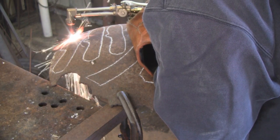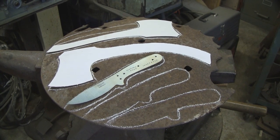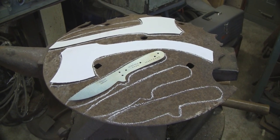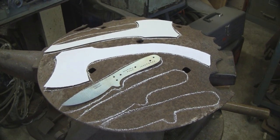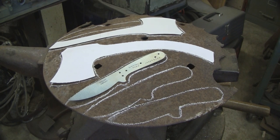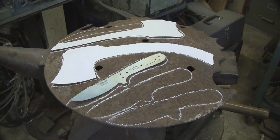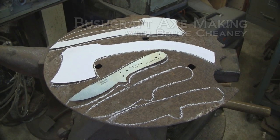I'll come back and knock the slag off the backside on my 2x72 belt grinder, and then I will heat those up in the propane forge and flatten them out. I'll repeat that process of heating and letting cool down a couple times so that will kind of stress relieve the metal and neutralize it. Then I will heat it up, make sure the axes are straight, and then bury that in a bag of lime till it cools down. It'll cool down real slow that way, and at that point the handles will be drillable. The axes will have slabs on them as well as the bushcraft knives.